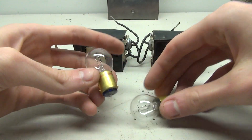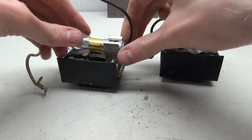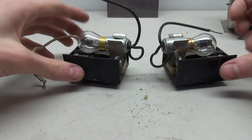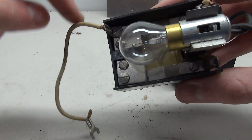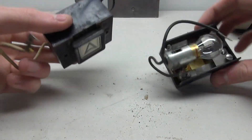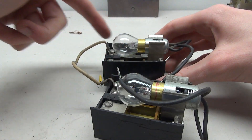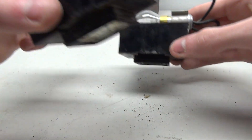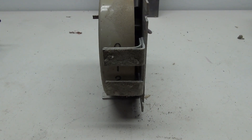I've got some of these larger bulbs and they will work on a 9-volt battery. They are kind of large but there's plenty of room on the back to put them. It may light up the wall a little bit when it's on the shelf, but that's just how the design is. Wiring these is very simple — it's just like any basic switch circuit. You've got one end here that goes to the positive of the battery, across the switch. This goes to one end of the lamp, so from here through the switch to the lamp, and then this would be the negative. If you're going to do two of them you would just wire them together: put the positives together here, connect the same wire to the other end of the switch, and then connect the two negatives together to the battery. So wiring this will be very simple. I'm going to finish up the restoration by cleaning up these rotodials and the plate, then get this all together and we'll see how it looks when it's done.